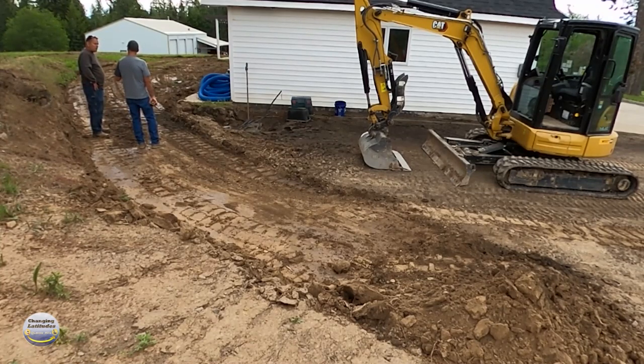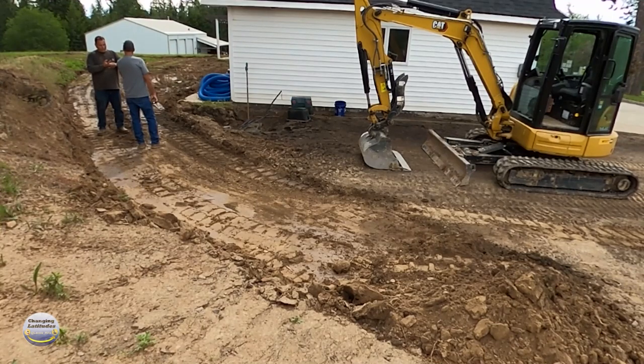Are you putting stones in the gravel? No. So the gravel should be, the hole should be 16, I think is what I counted. 10 inches of base, and an inch for every foot of wall. The peak of that wall is 5 feet. Okay? It's right here. And it's not even 5. It's like 4.5. So I added, so that's a 10 plus 4, right? Plus you're supposed to put a brick in the ground. Which is, yeah. So it gets you to 20 inches. That's the depth.